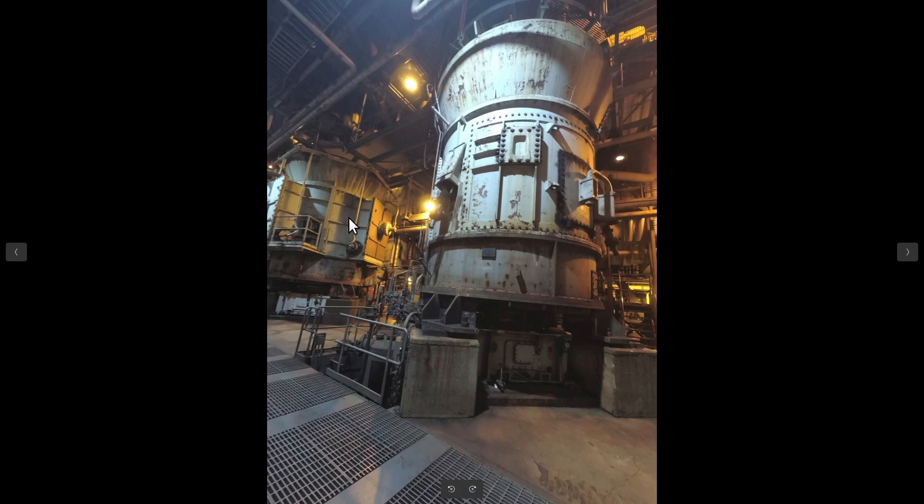This is the newer style, the MBF. On this one the rollers are fixed, while on the older one the rollers are on a satellite arrangement — three rollers in here. The turntable moves and the rollers kind of follow it; they're free to move. There's a thrust ring on top of springs that puts downward pressure on them. There are only two of these left; they're used for the upper burners.